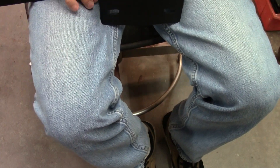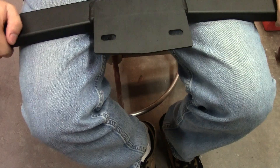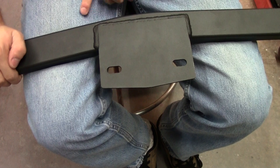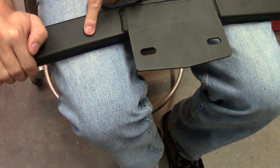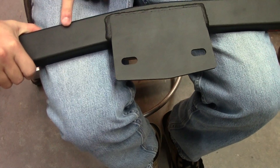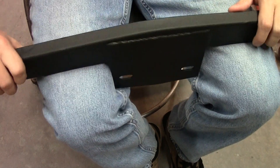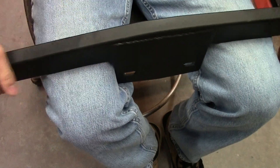This beam is pretty big — I'm going to say it's a two inch by one inch square tubing, and obviously it's been pressed. It looks like there are also two notches, one here and one here. Maybe that's for holding down the bar, because they're in the exact same spot, parallel with each other, at the exact same distance from the center. I'm thinking that's there for holding the bar down while using the press to bend it.